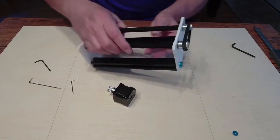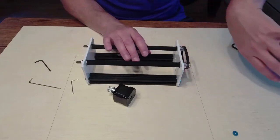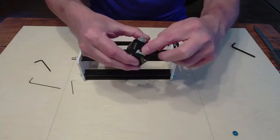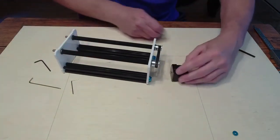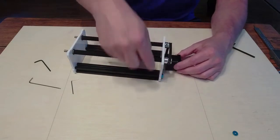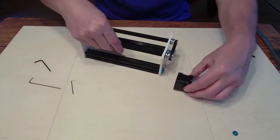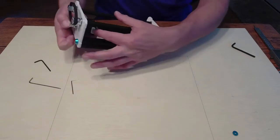If you're looking at the machine, the gears are in here. You're going to want them positioned so that if this is your laser, on the back left corner is your control where your wiring plugs into your wiring harness. So you want your motor harness facing that direction. Basically the wiring harness is facing away from you when you're putting it together — when looking at this end, the wiring harness is coming out this way.